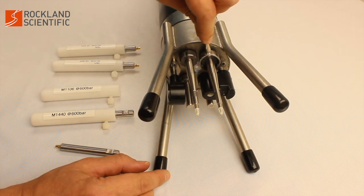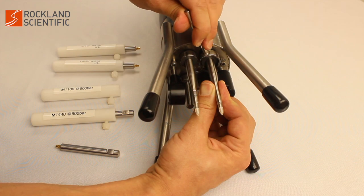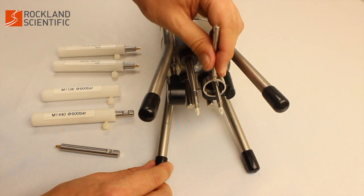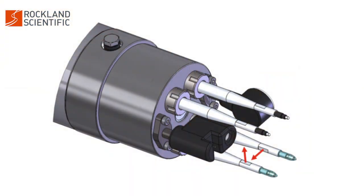As you tighten the probe holders, ensure that the shear probes are oriented correctly. Typically, one shear probe is aligned with the instrument's x-axis through the on magnet, and the other with its y-axis. The sensitivity on a shear probe is in the direction normal to the flat section of the probe's serial number.